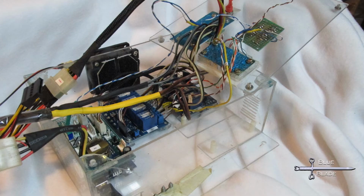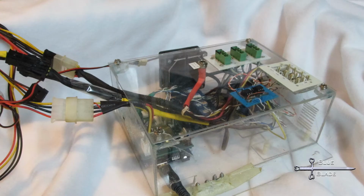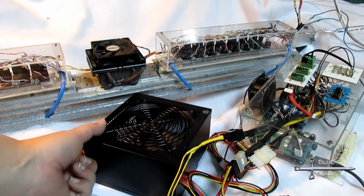The 2 PWM signals come from the controller hat on the left. The output goes to the pin headers on the outside of the box, where the light cables will connect. 5V DC and ground also come from the pin board, as I have power connected there for the fans and the top-off valves. Here it is in action.